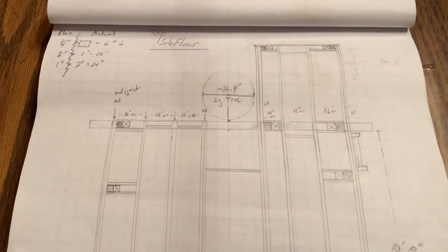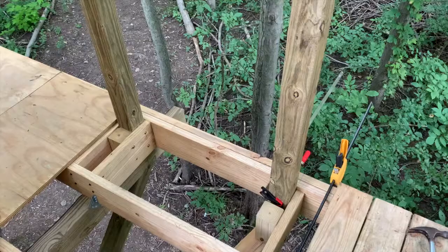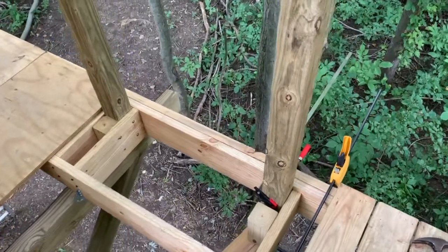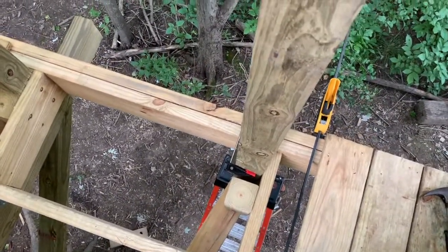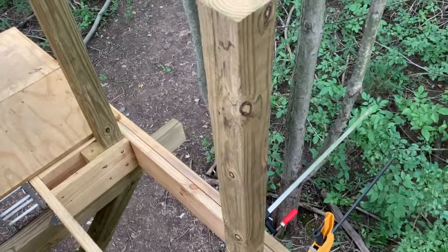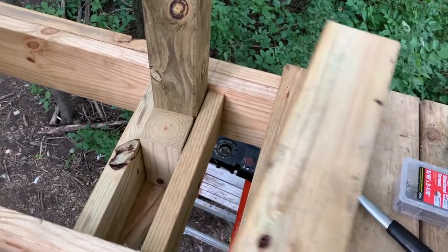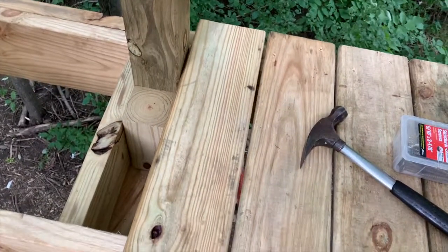There was one more railing post that I was waiting to install that I'm going to have to put in now. The reason I wanted to make sure that it was going to line up exactly with one of the deck boards, so I didn't want to install it until we had gotten to this point with the decking. And now this will line up perfect on the board, so I'll only have to cut a notch in one deck board instead of two.